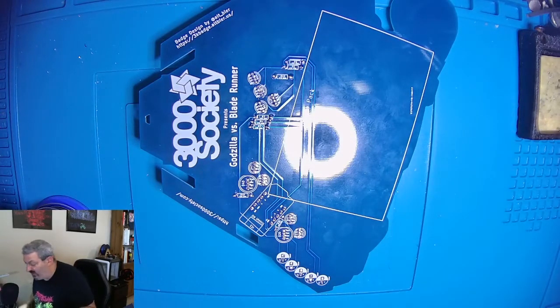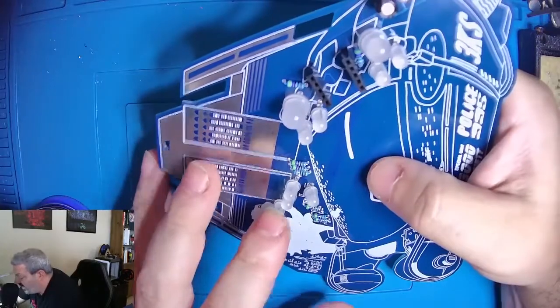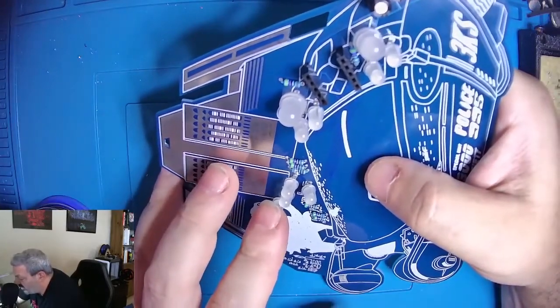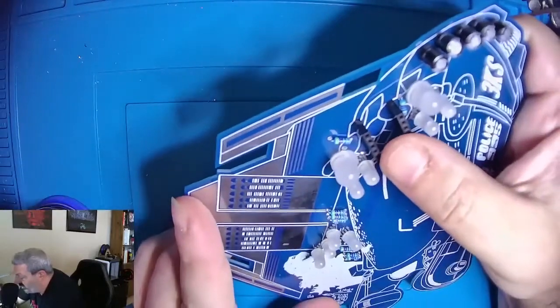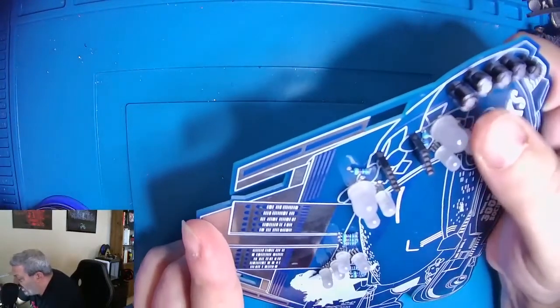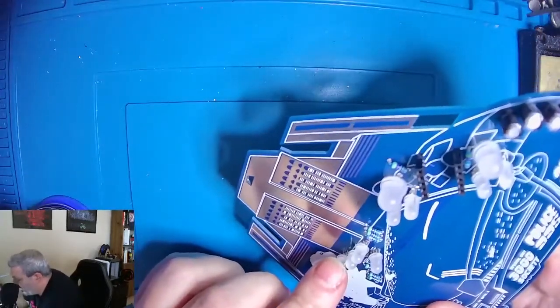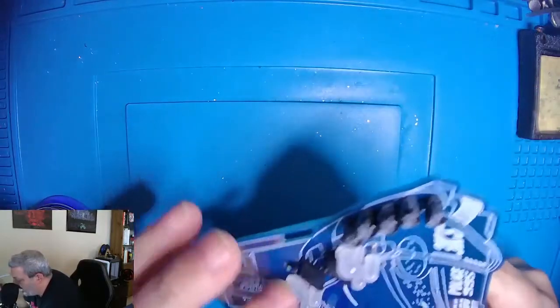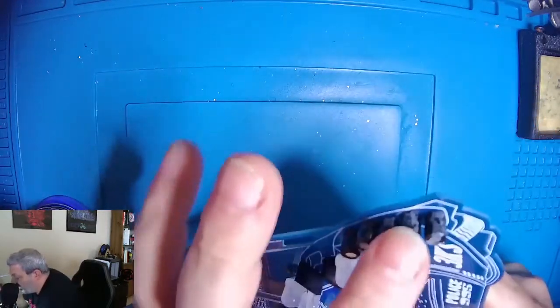So each one of those NeoPixels has a red, a green, and a blue LED. And when all 3 are lit at the same time to make a bright color, it was actually more current draw than the trinket's pin could handle. And that's why these are bridging the gap. That doesn't happen often. It could do 1 or 2 colors fine. It was only when all three hit that it was too much, and it would cause problems in the circuit, and that's where these became a requirement.